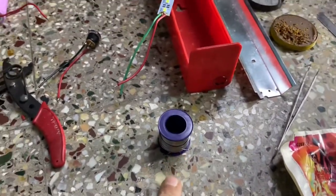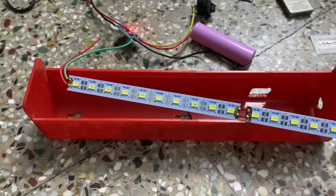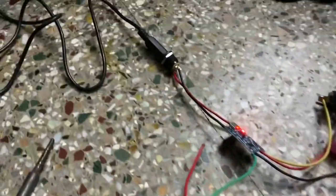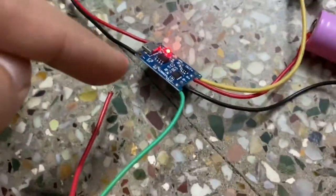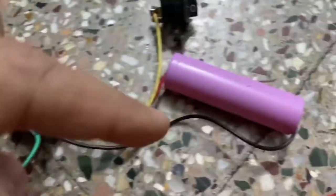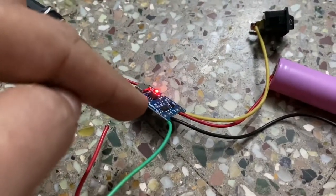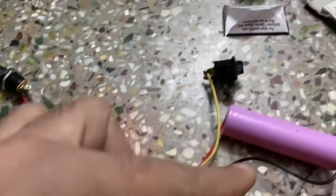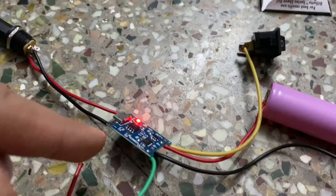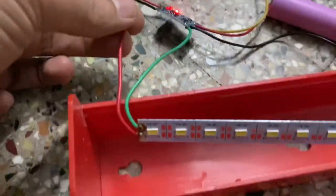The project is now at the second-to-last stage. Here is the 5-volt USB charger with a jack for charging. There is a lithium-ion battery charger module — the red LED is already glowing, which means the 3.7-volt lithium-ion battery is currently charging through the charger circuit. It has overload protection and when the battery is fully charged, it will stop and the green LED will glow. There is also a micro USB port on the module which I'm not using, and the output goes to the LED strip.